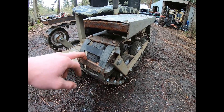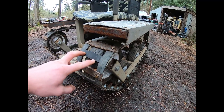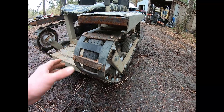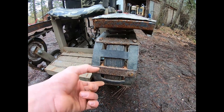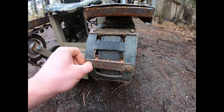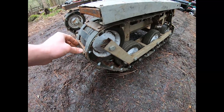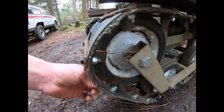I'm cutting the rubber track. I decided to alternate metal and rubber all the way around rather than putting metal cross-pieces on every single one-inch interval. That saves on weight, cost, and power required to move it. The rubber itself is cut into a five-inch by 88-inch band, with three-inch by three-inch squares cut out leaving an inch between each one. In the center of each square is placed a metal brace bolted on with nylock stop nuts and washers. There are 22 of these plates per track — that's 110 inches of one-inch by one-eighth-inch flat bar per track.